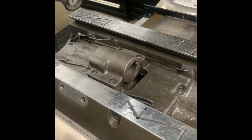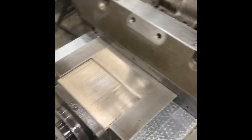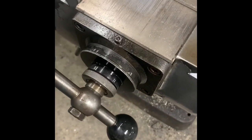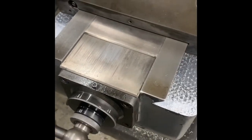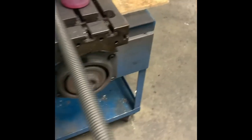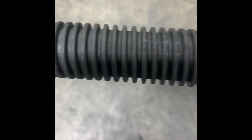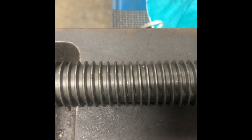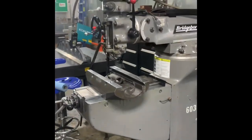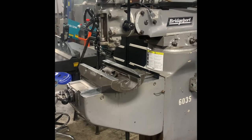A lot of the time the nuts do need replacing. In this case they were in really good shape on the Y axis, and we have about three to four thousandths backlash in the Y — nice, smooth, full travel. Now on the X, this screw is trashed. The land is pretty good on the outsides but when we get towards the inside — look at that, there's no more land. You'd probably have about 25 or 30 thousandths backlash. I'm not even going to check it. I ordered a new screw, and if it gets a new screw, it gets a new nut. So on a serviced Bridgeport from Machine Tools Rebuilt, you're going to have less than 8 thousandths backlash in either direction.